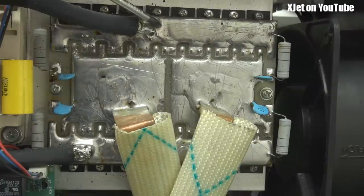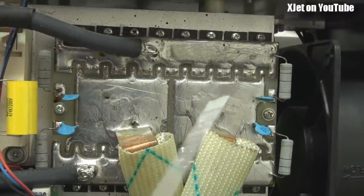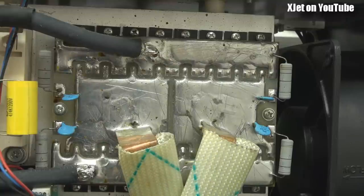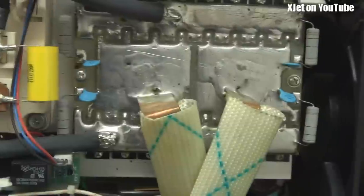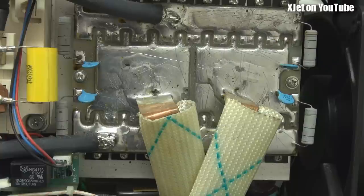On the back of this board there's a massive row of devices along the top — probably diodes, since they appear to be two-terminal three-pin packages with two pins joined. These clamp the voltage coming out of the transformer to prevent nasty voltage spikes that could damage the expensive IGBT transistors. There's no capacitor filtering or smoothing on the output of this inverter, so it's basically rough output. There are also some small capacitors down here to further help suppress spikes.